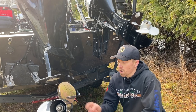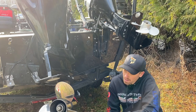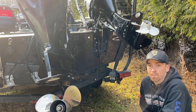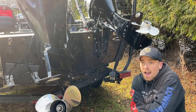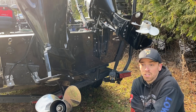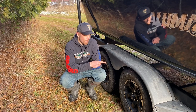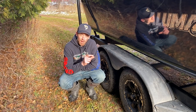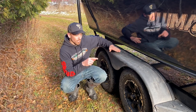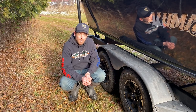On the backside I'm running a stainless steel prop — the Mercury Vengeance, 48-16-314 with a 17-pitch. I've also got my 9.9 Pro Kicker, mainly for trolling applications, and on top of that I have the Trollmaster 3 installed so I can lower and raise my RPMs, which is clutch especially when trolling the Great Lakes. For trailering, make sure you get the right hitch ball with the right drop or raise for your truck so this thing is level — you don't want to prematurely wear the front or back of your trailer.